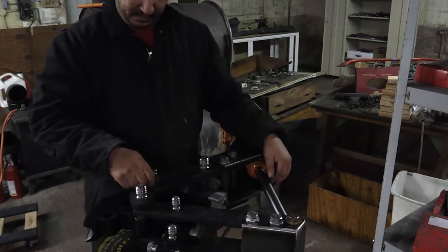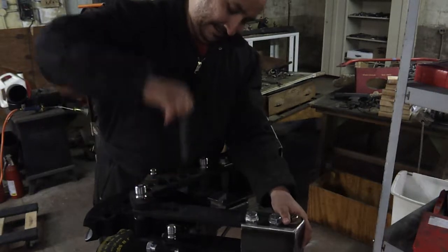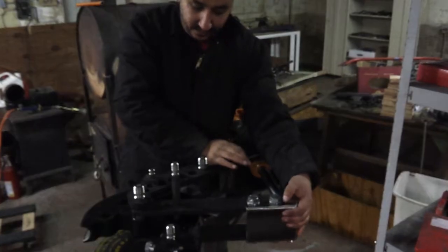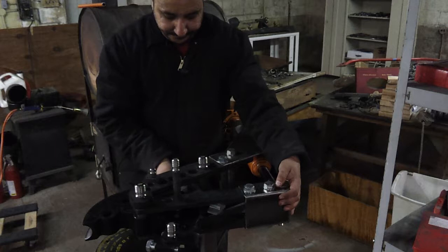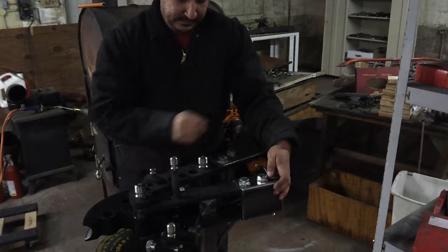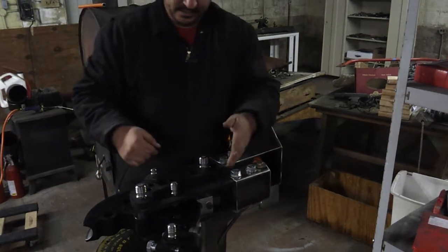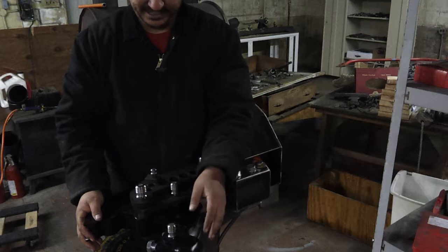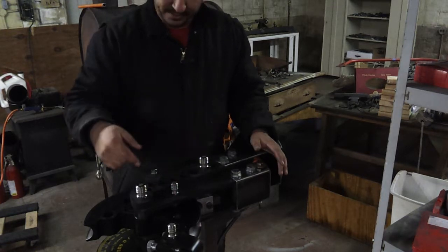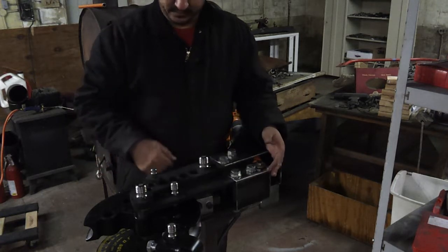Okay, so the anti-springback pin is holding it right there. So I'm going to pull this pin out, compress this a little bit, drop the pin here, and start compressing it all the way. I have to lift this die set up because there's no tube in here to clear this arm. But if you watch, this other pin will drop into that hole — boom, it's reset and ready to go. So now I have a bit of a bend on here if there was a piece of tubing in here. The reset pin's in there, and the anti-springback pin will lift up as you just start going and drop into the next hole. So I would just restart it and continue on.